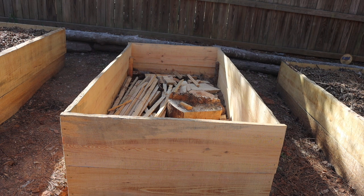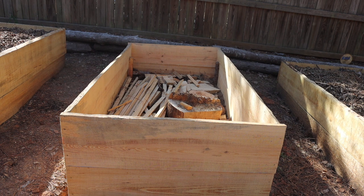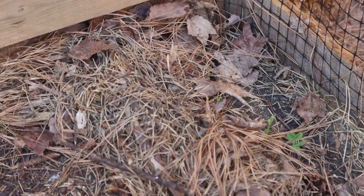After I rolled the log, I was able to put the chainsaw back on the mill and then mill the rest of that log down. So what I ended up with is a semi-straight edge that I just snapped a line on and did a rip cut using my circular saw, and that gave me a nice straight edge. And then from there I could square up my edges, cut it to length, and then of course build this bed. So I have that going on for me.